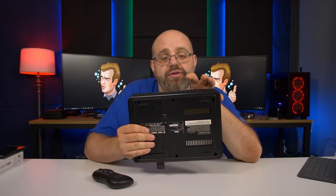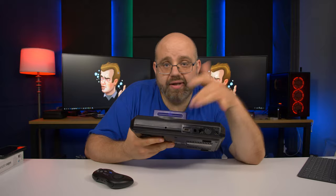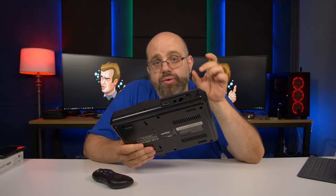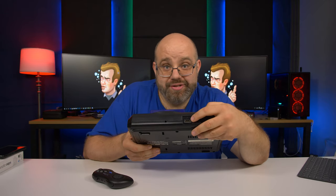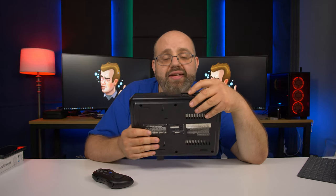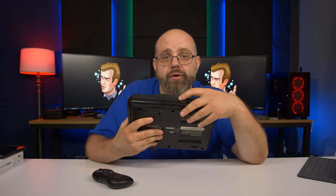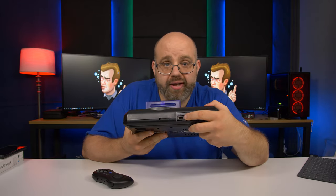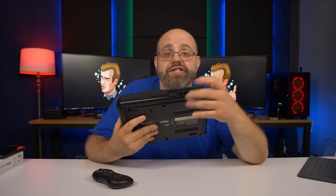So what we did, there was an actual HDMI out, as you see there. We didn't have to drill anything into the case or do any kind of magic. We just got a short HDMI extension cable, and it fit perfectly, as you see, where that serial port was. So we desoldered that and put the square part of the HDMI extension cable, with the female part of the HDMI port, right where the extension was, and it just fits there perfectly.